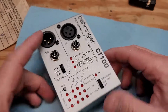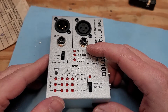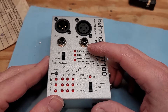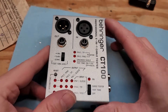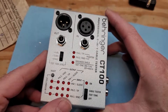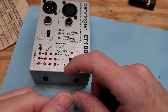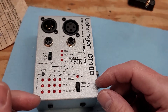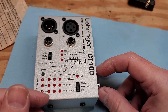That's my quick and dirty video on the Behringer CT100 cable tester. Very useful thing — I used it to help diagnose a problem with the cable, and when I tried to fix it, it told me there was still a problem. Which then helped me identify that the fault was actually halfway through the cable, so I knew it was garbage. Helpful little device — it saved me a bunch of time. I'm now going to go put some ice on my finger because I feel like this has turned into an ElectroBoom video. If you like what you saw, please click like and subscribe. Thanks for watching.